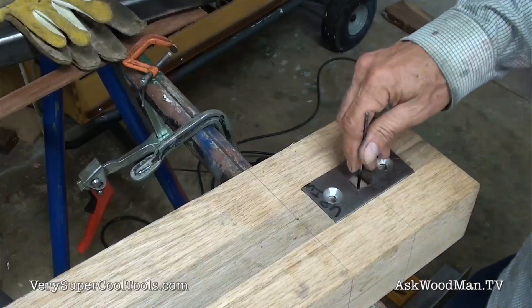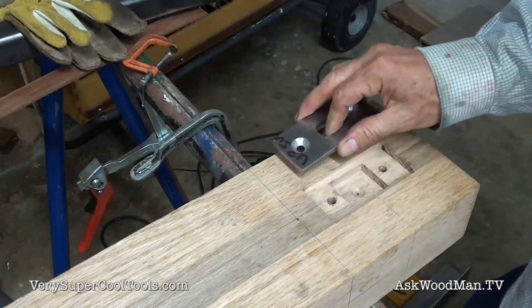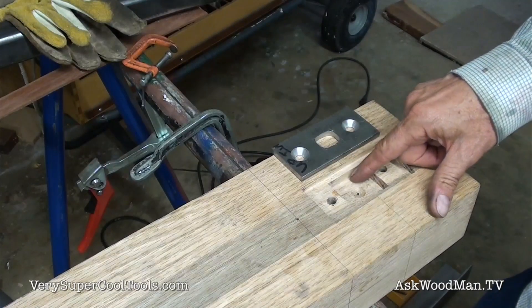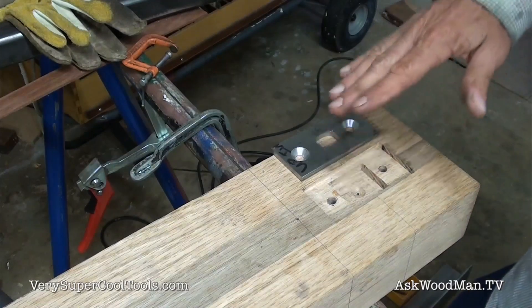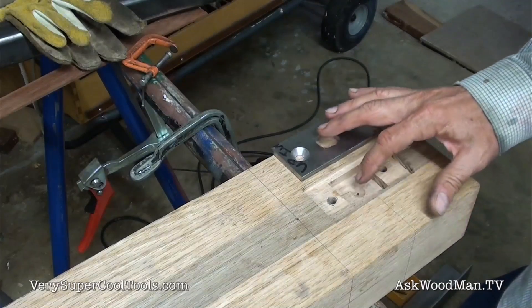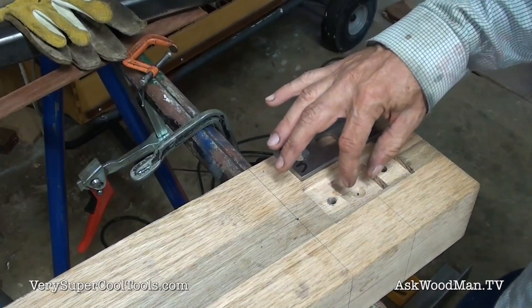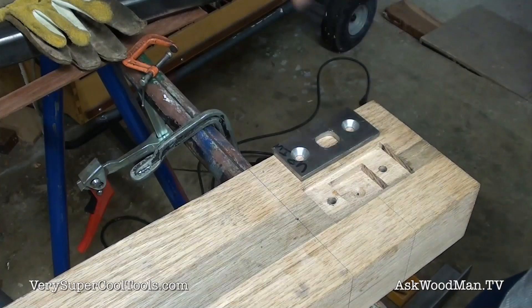Here's my arrangement. I've got this plate — this is just my retainer — and then inside here there's going to be another piece of 3/8 inch plate. It's going to be softened off on the bottom, so as the thing kicks in, it can rock slightly. This is going to be free-floating in here, so as the thing racks, it's going to allow some adjustment to keep from putting too much pressure on that screw through the two bushings.